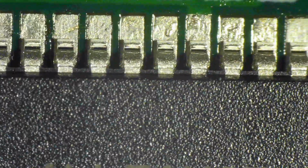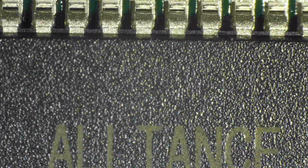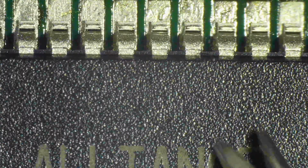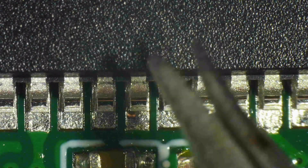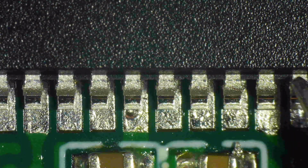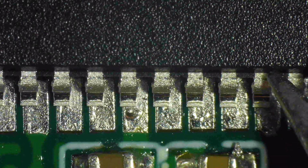Or I'm just inspecting. Now you have to inspect everything. Once you've stopped touching the chip, you have to inspect the whole thing. Because if you caressed it on one side and the alignment improved in the field of view of the microscope, you could have destroyed the alignment on some other place on the chip that is outside view. So once you are more or less satisfied with it, you have to check everything, every single pin, before you say, okay, this is now properly aligned.